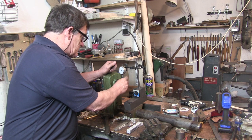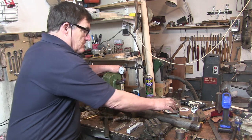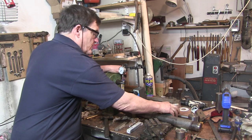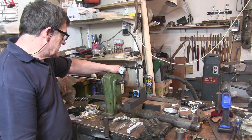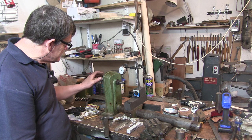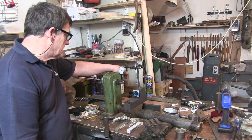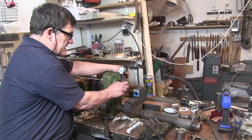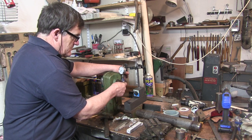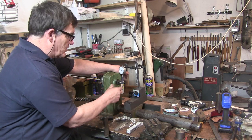My plan: I've got a cup wheel and I've got this diamond wheel. That's the cup wheel and the diamond wheel — I only just bought the cup wheel with this in mind. I've got about two to two-and-a-half thou runout on there. My plan is to make some JT6 sleeves to just push onto here and thread them and screw them in. There's a nut here that will push it out, and whether I make one sleeve or each wheel with its own, I don't know.